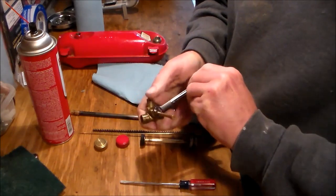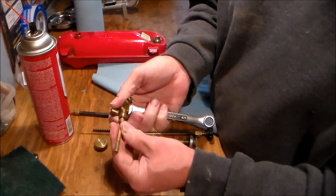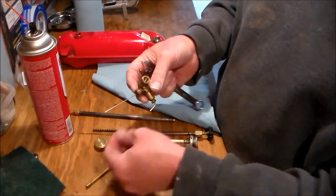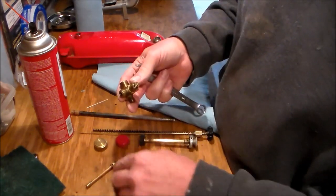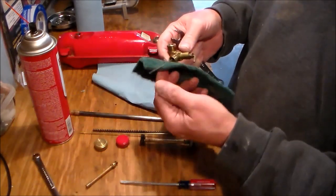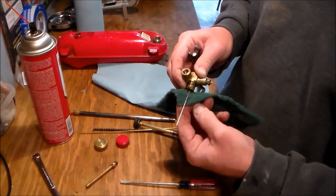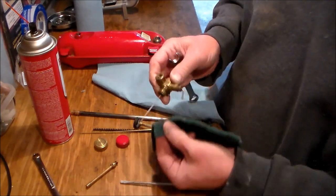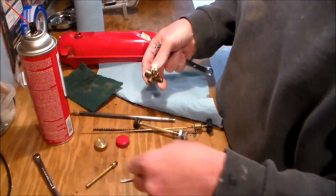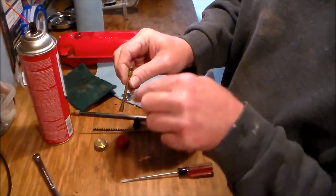A vice is actually better for doing this, but this came off pretty easily. Again, another needle valve — and just like the other one it's got corrosion up here on the top where the air inlet is, and we don't want that. So scotch-brite, moving one direction only toward the end, and we just clean it. That's all it takes — just a little bit. Now I'm going to take the same brake cleaner and spray some down in there to clean that nozzle out.